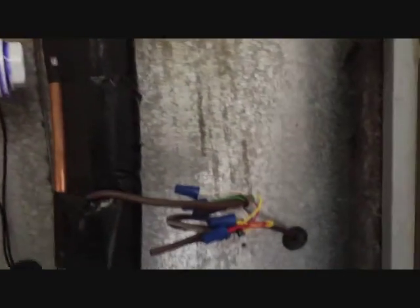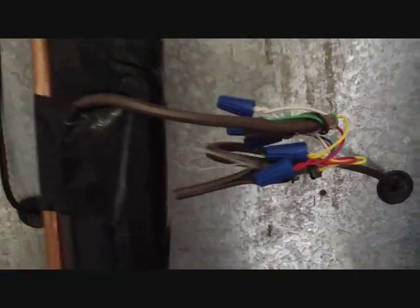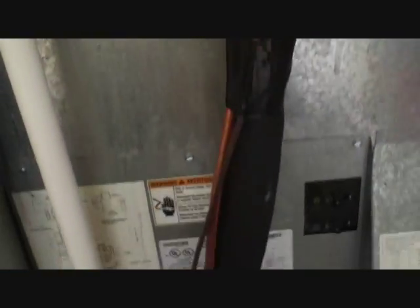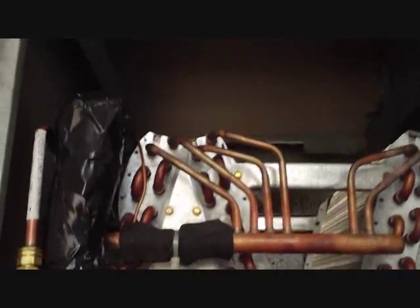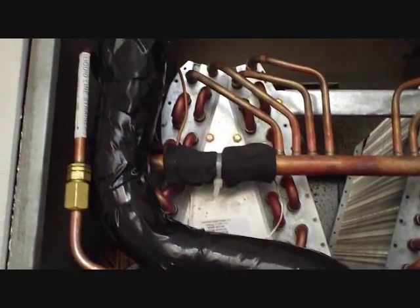We added our safety switch to the drain in case that P-trap down there gets blocked up and backs up — the safety switch will trip off before we have a flood, because all the electrical components are below the coil. There's our little wiring splice there — everything's wired up low-voltage wise and we're about done. I'm going to head outside and do the low voltage out there, and then we're going to punch a new return grill in because we're going to close off this furnace with a wooden door and get the return air through the wall.